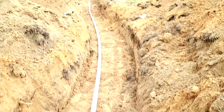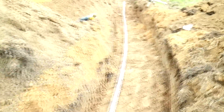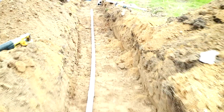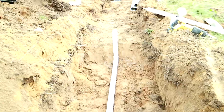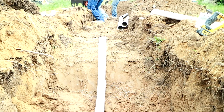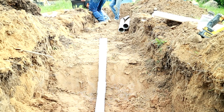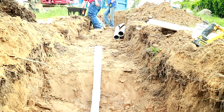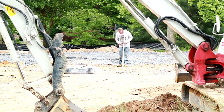You can see there's our two-inch pressure line coming out of the lift station. Down at the end where the elevation gets higher, we're going to raise it up — but that's before we connect the four-inch. You can see we've raised it up, but we haven't yet determined our elevation. We need to take some shots with the transit to determine our elevation so we can figure out where we need to set our pipes.